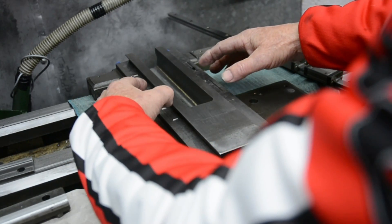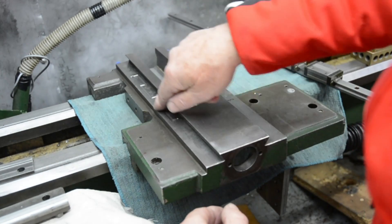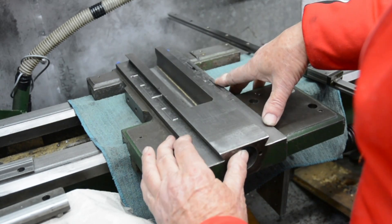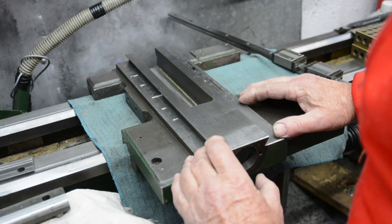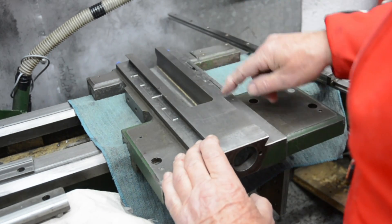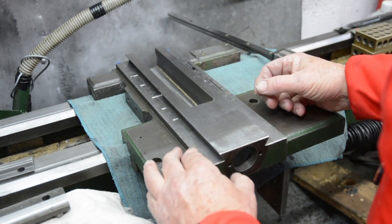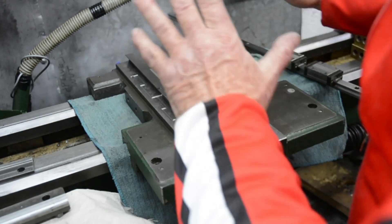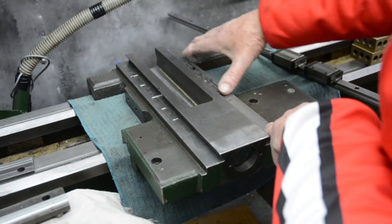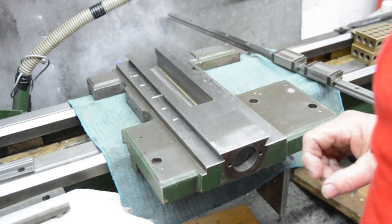The way to get accurate faces is to take great care of the alignment of these rails. Now the other way there could be an error is on these two surfaces. Over the years they've been subject to a certain amount of wear, and also the owner of the lathe before I had it did some very bad scraping on these surfaces — which wouldn't have been necessary at all because any wear that had taken place would have flattened it better than his scraping. So I'm not 100% certain how good these surfaces are, and I intend to machine them flat in the same setting.